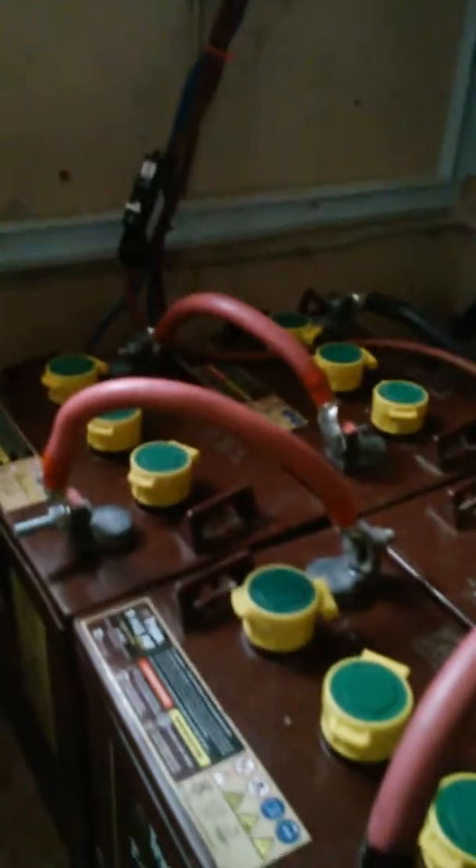We've had incredible success with this system. Someone put pure water in the freezer and you can see it's frozen — the solar is powering the freezer reliably. We're going to expand to three kilowatts in panels to match the three kilowatt inverter, and we'll go to four 100 amp-hour batteries instead of the two 50 amp-hours, so we can run an air conditioner. Thank you for watching.